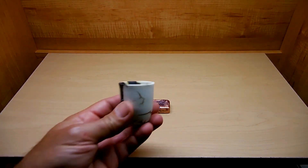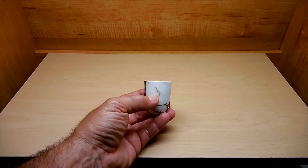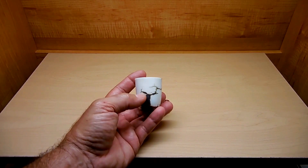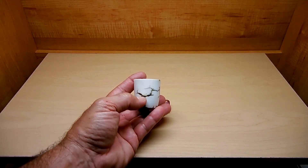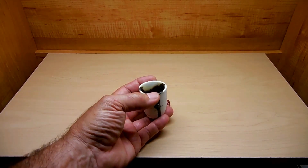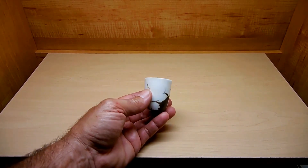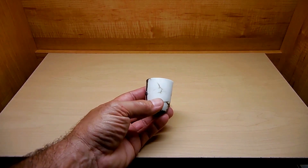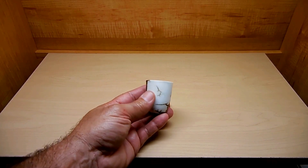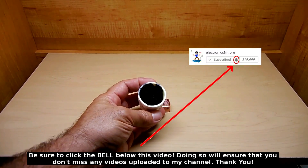This is a look at the crucible now — it's an aluminum oxide crucible and you can see it actually developed cracks. There's a crack there, a crack here, and right in this area of cracks you can see copper poured out and ran to the bottom of the crucible. Over here is where I had the copper fitting resting on top in the furnace; some of it dripped over the edge. I don't think I'm going to use this again — even though it's rated 1,600°C and I was only around 1,200 to 1,225°C — so I'm going to switch to graphite.